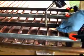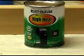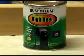The soldering process causes the copper to ripple. This is fine. The other side of the sheet is the face of the panel. I sandblasted the face of the panel to roughen up the surface for painting. I used Rust-Oleum high-temperature paint without a primer and sprayed the face of these panels. I let the panels hang in the basement for about a month to let them off-gas before putting them into the boxes.